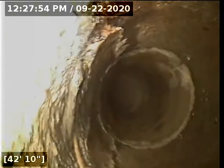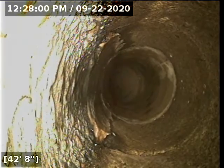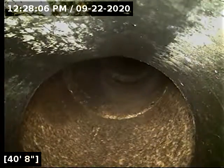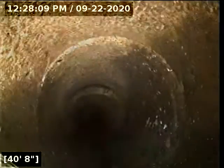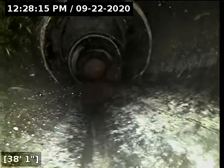So at this rate, the concrete pipe is still in good condition. I wouldn't recommend updates or repairs on it at this point. Of all the pipe materials in here, the stuff that's not updated, especially concrete, will be the first part that wears out. So just keep that in mind. It's a very difficult spot to locate, though. But I am picking it up past the fence line, about a foot or so prior to the street edge back there.